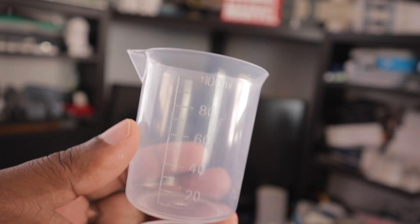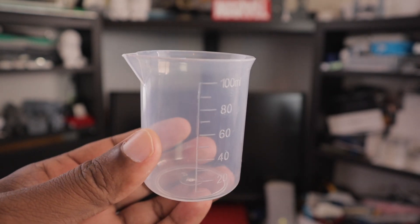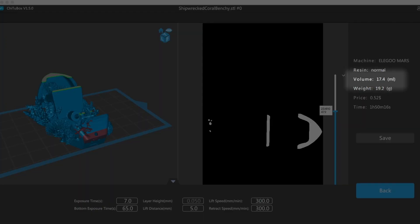One, you could use a small measuring cylinder. Some manufacturers include a measuring cylinder when you buy their printers, such as the Elegoo Mars, or you could get a small one in a chemistry shop or pharmacy. What you're going to do is look at your slicer — a lot of times the slicer will tell you how many milliliters of resin your print is going to take. You need to calibrate that to tell that you're going to have enough resin in the vat. Now you don't want to put exactly the amount required — you want to make sure you have enough to cover the base of the vat and then pour the required amount.